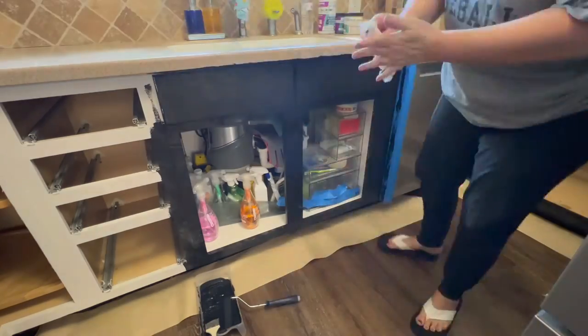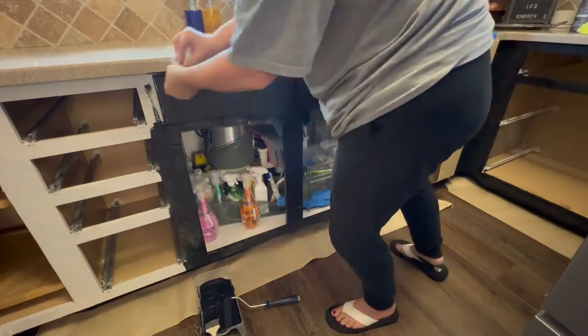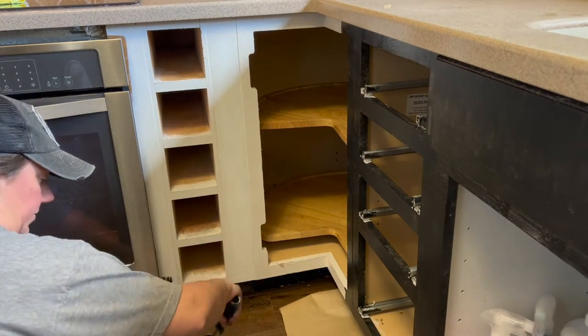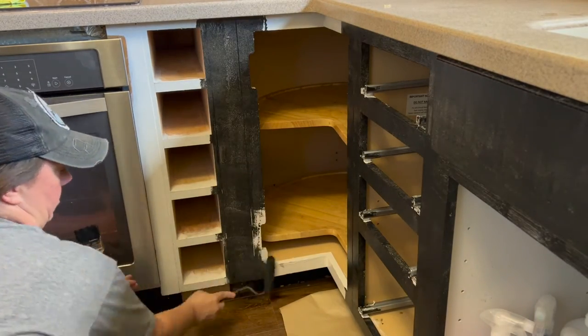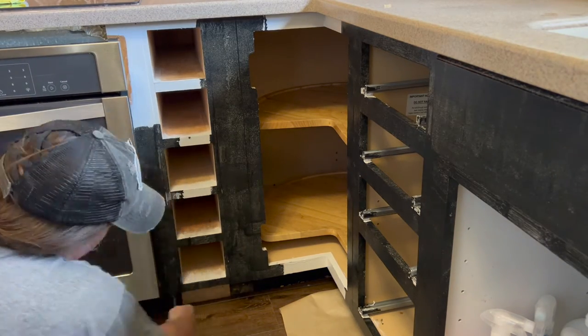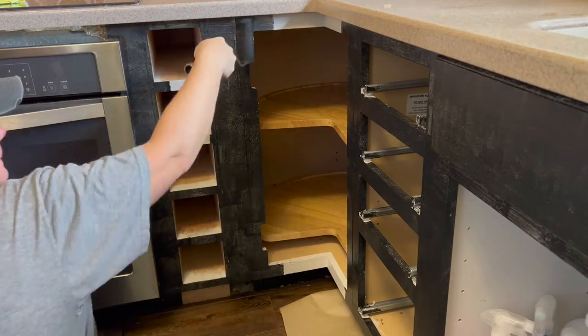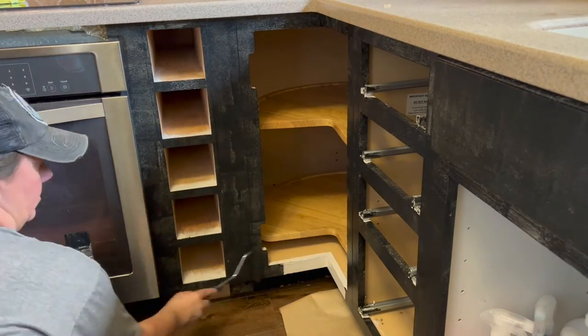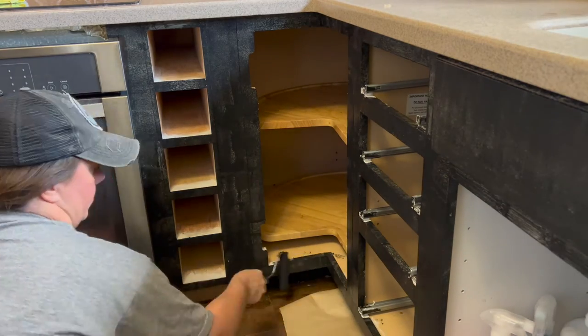It's really important that you use the roller because of the type of paint, that self-leveling paint, you don't want to see brush strokes. So you only use the little brush to do a stippling or a smushing motion into the cracks and crevices. And then you use the roller primarily everywhere else. And if you follow their instructions, you'll be really successful.